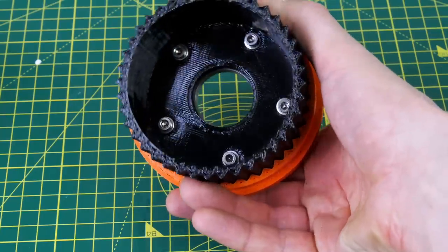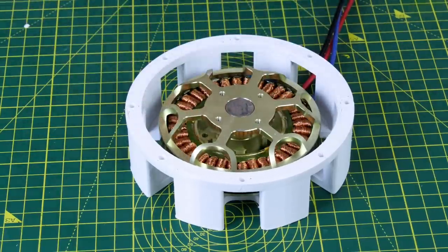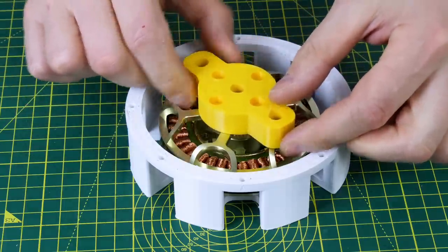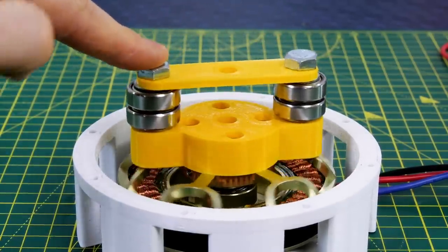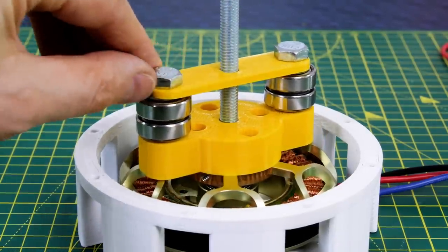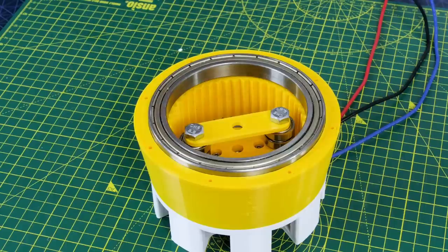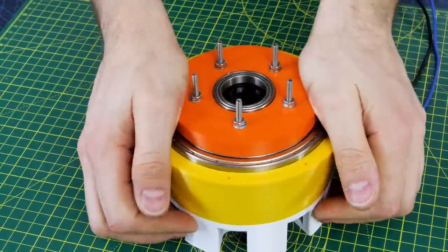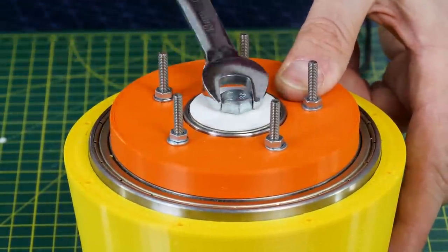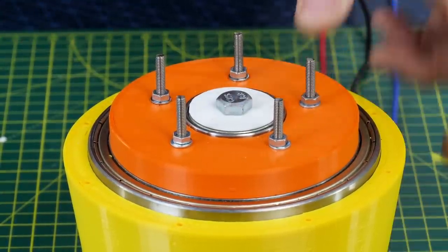The flex spline and the rigid output piece are bolted together, but this time I've put the bolts facing outward so we can attach something to it. I'm using the same motor that I used with the cycloidal drive, and this holds the wave generator. The base of that is a 3D print with three captive M8 nuts in it so we can screw that onto the motor and screw everything on top. All assembled it looks like some bearings spaced with washers and another piece on top to brace those apart. In the middle there's another captive nut which allows us to put a further bolt in that will go all the way through to the output. The motor mount just screws onto the bottom of the main body, and the last step is to put in the flexible spline with the output. Now to hold everything together there's the extra bolt in the middle which is mounted on a bearing in the middle of the output disc — putting that bolt in is going to hold everything down so the whole mechanism doesn't ride apart in use.